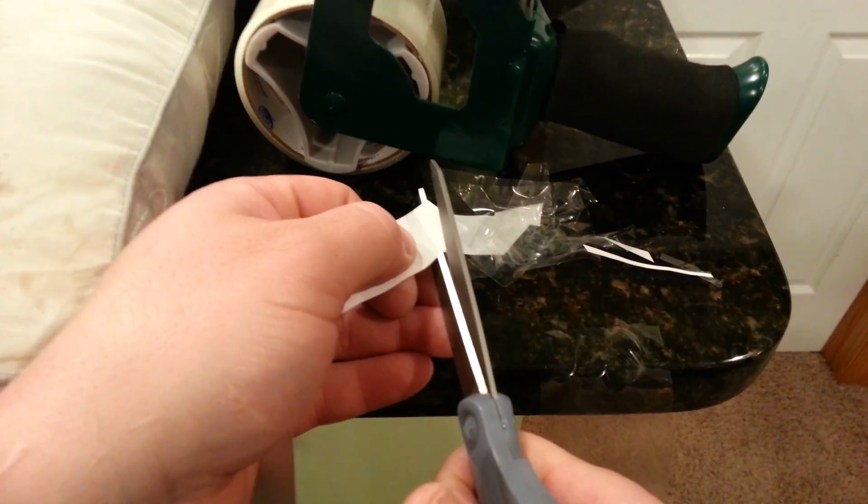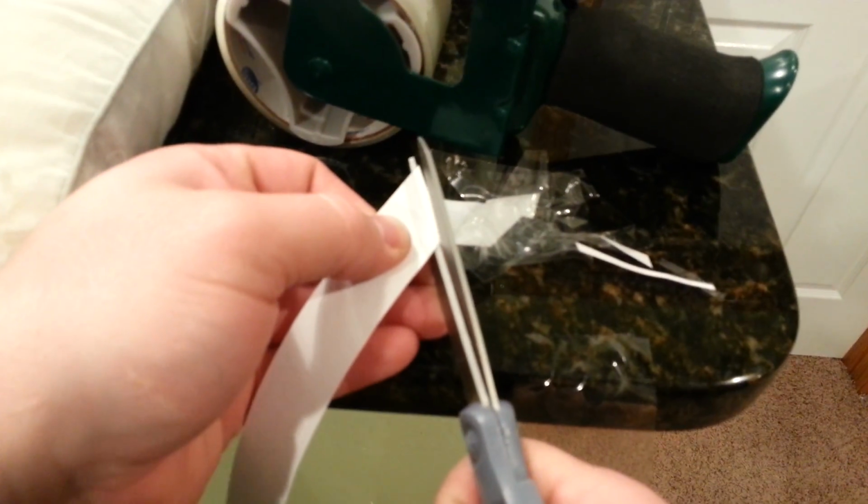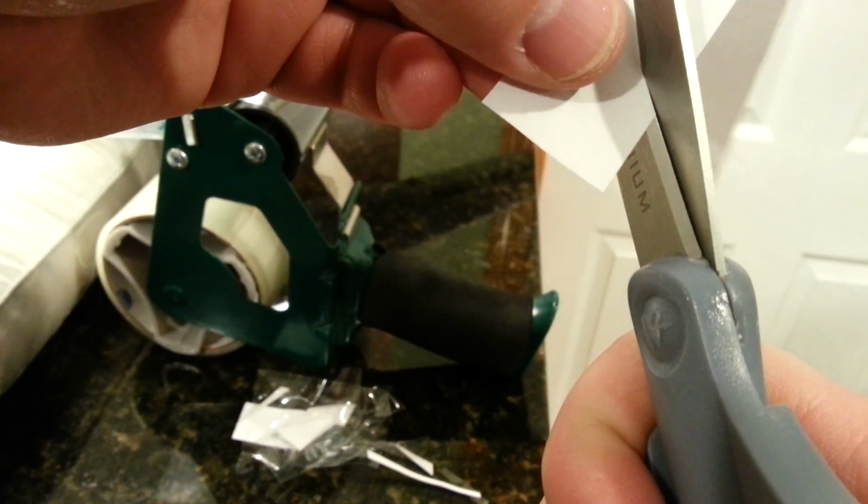sturdy. Okay, so now this middle one, this one will be again also quite straightforward. Just make our first initial cut so we can line it up there, and then go ahead and get it trimmed to needed. Okay, see what I've done? I just forced it into that crack, and then I have a seam that I can watch, and then I can cut it, because this one's going to be tight. You want this one to be tight.